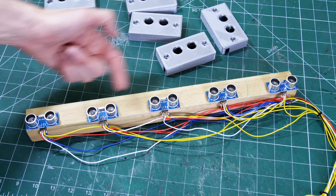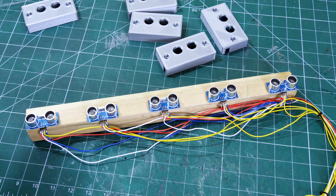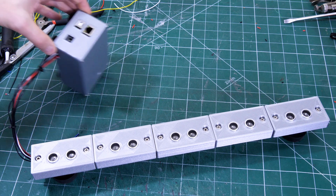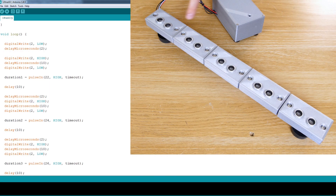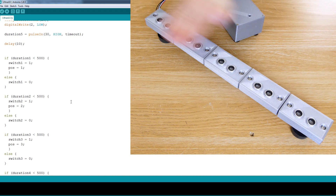The next interface is a bunch of ultrasonic rangefinders currently attached to a piece of wood, but I've got covers made for them to mount on a nice piece of extrusion. That's going to make a kind of Jedi hand controller that you can wave your hand in front of to get a position value. It's mounted on a piece of 2020 extrusion with rubber feet so it sits nicely on the desktop, and the Arduino with its Ethernet shield is in a box with rubber feet too. Each ultrasonic transducer has a trigger pin and a receive pin — you pulse the trigger pin briefly, then listen on the echo pin to receive how far away the object is. I've combined all trigger pins to pin 2 and am pulsing those, then listening on the echo pin across five different sensors to work out the position of something above the array.